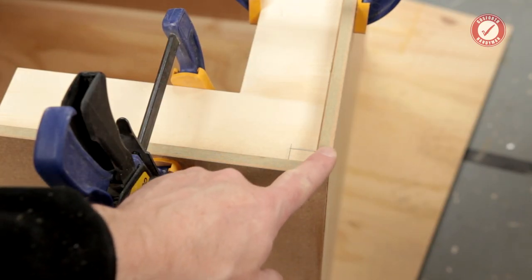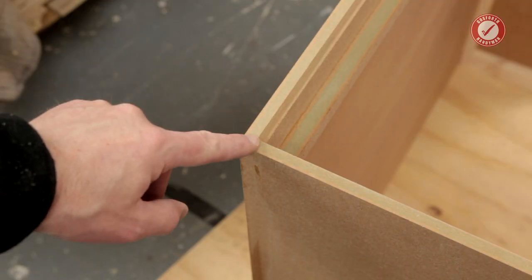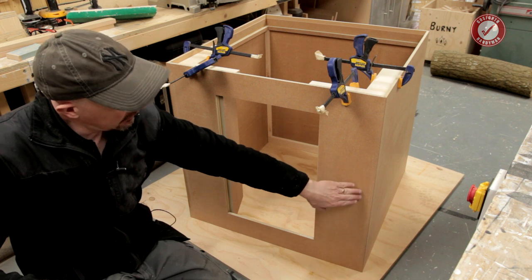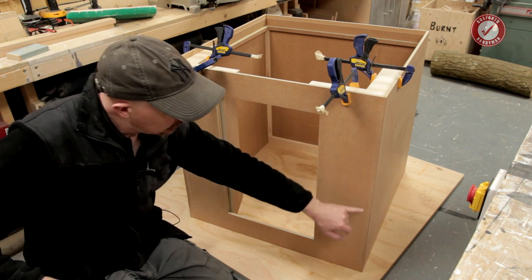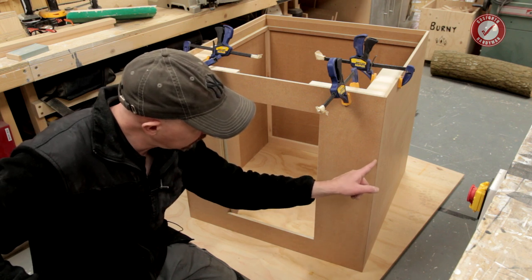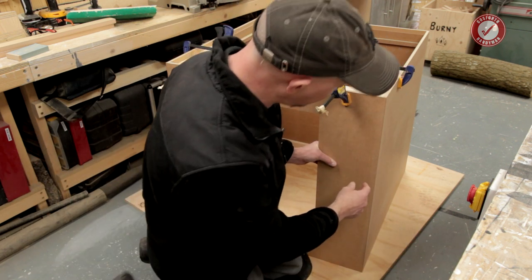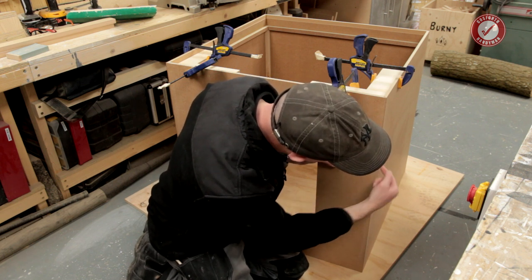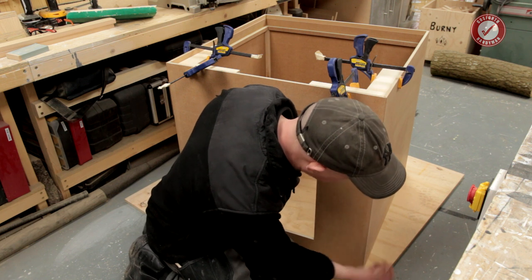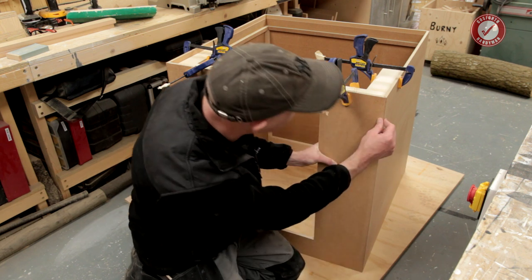The main thing I've been checking when putting it together is getting all of these top corners of the mitres perfectly in line, absolutely all the way around. No sanding or anything — perfectly in line. In terms of brad nails, I've gone for five nails in every corner: three into the support timber and two into the edge of the mitre. Sometimes I come in from one side, sometimes the other — it just depends on where you get a better join. You don't want to force the mitre in too far, otherwise you'll end up with a ridge.